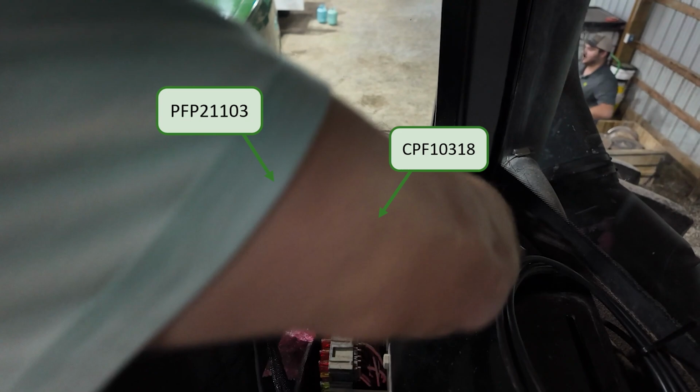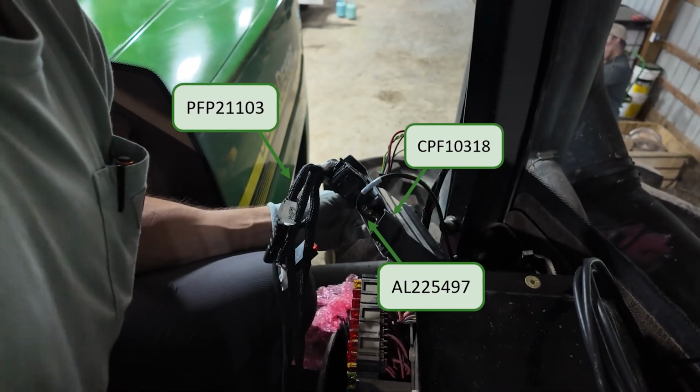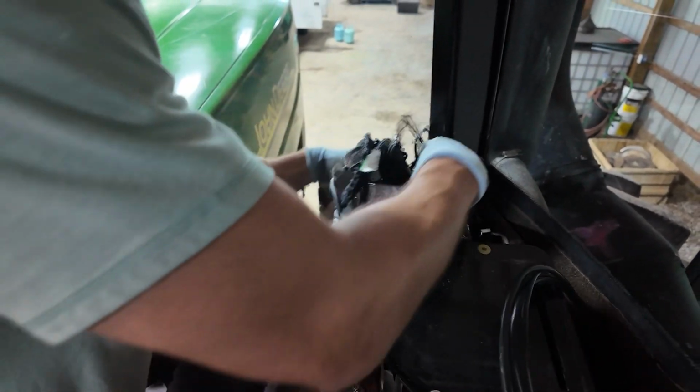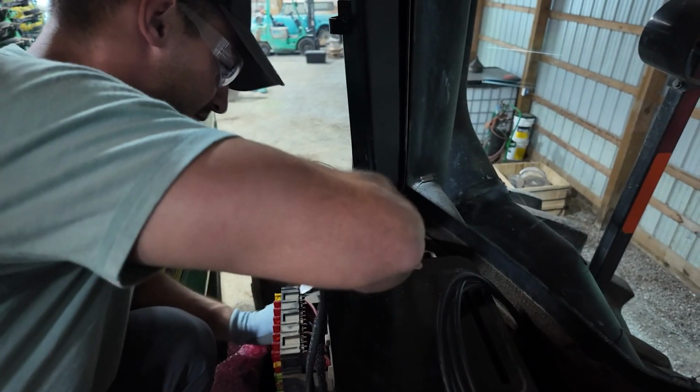Connect the lock lever portion of the harness to your modem. At this time, connect the optional antenna and Ethernet cable to your R modem. If using an M modem, the Ethernet cable provided will connect into the harness.